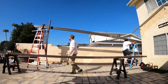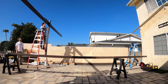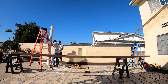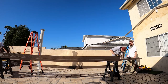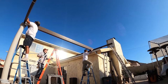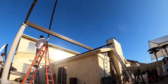There are the brackets put in the right place, and here I'm just checking level going that way on the gable, and then the level going away from the house on the gable to make sure we're attaching at the right height. Here we're sticking the steel back into the column and then inserting it in place so we're ready to put the actual beam on top. This is the steel beam being attached at the house, and on top we have a steel beam connecting each side of the gable.